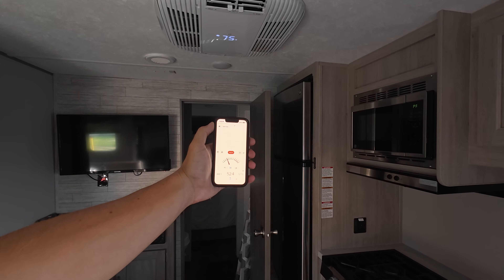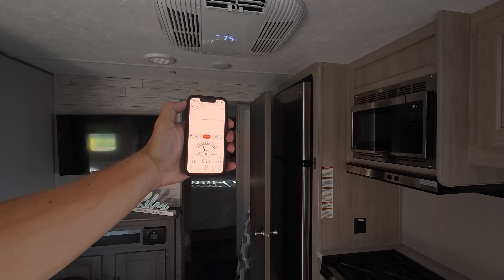Now that the AC is running, let's look at the sound levels. When we installed this AC we were super excited — initially it seemed so much quieter than what we were used to. I'm going to use my phone as a decibel reader and get a volume test for all three units. To keep standards consistent, we're testing all units while ducted with the direct dump closed, measuring on both the low and high settings.